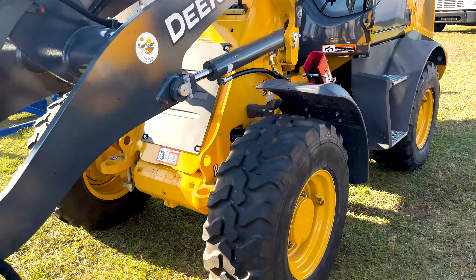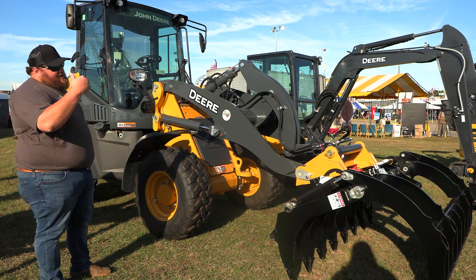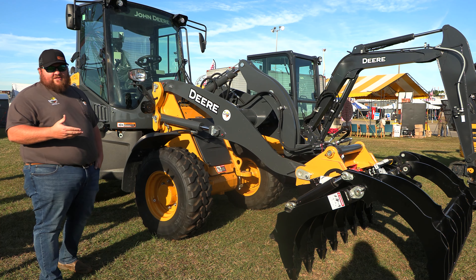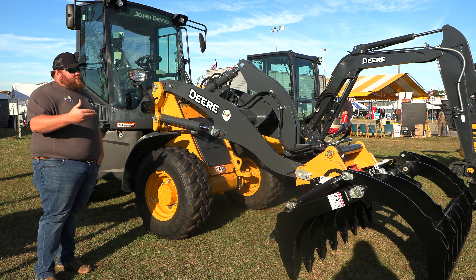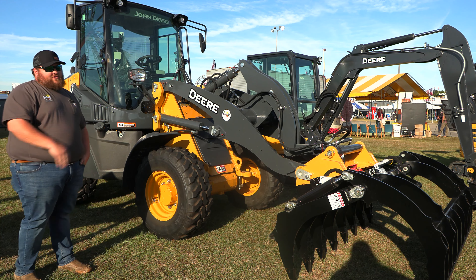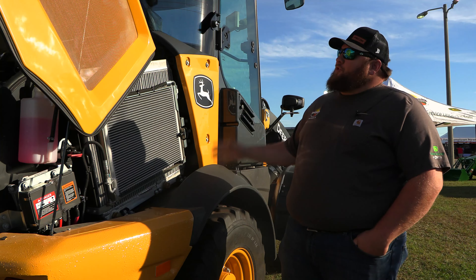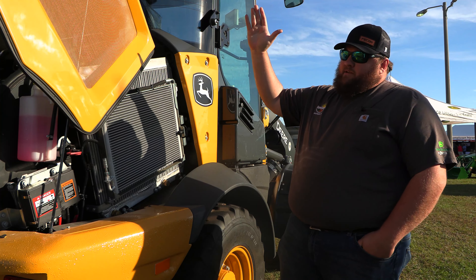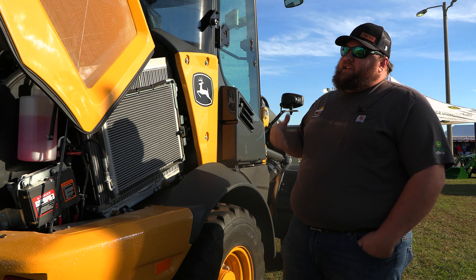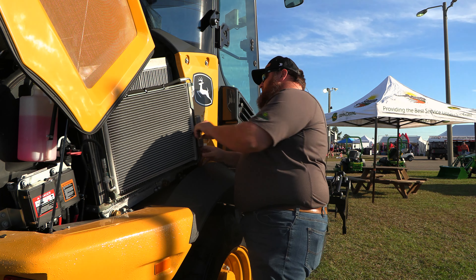Going back to land clearing and cleaning up debris piles — we're in an area that gets a lot of tornadoes during the summer and through hurricane season, so you could do a lot of cleanup with this machine. It's a 12,500-pound machine, 73 horsepower, so you're under that DEF mark and don't have to worry about dealing with DEF fluid. Your rated operating capacity is around 4,000 pounds, but your actual tipping capacity is upwards of 8,000 pounds — a good strong machine, close to 70% of machine weight that you're able to pick up and move around when you actually need it.